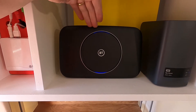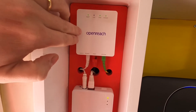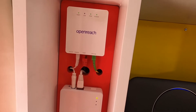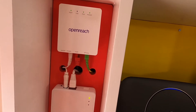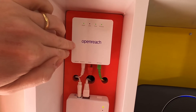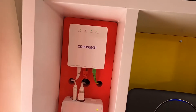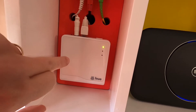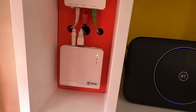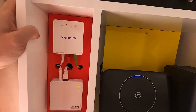We've then got the BT wireless access point. On the left-hand side we've got the fibre optic modem — this yellow fibre optic goes all the way through to the switch outside. We've got a full fibre-to-the-home setup here, which is very different from fibre to the cabinet, so we get full 1000 megabit per second broadband coming in, which leads up to the switch. At the bottom we've got the Hive system — the central heating system that controls the heating and enables wireless control from mobile devices.